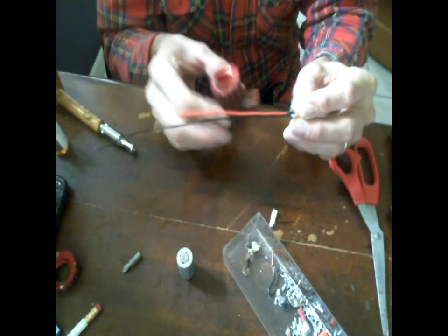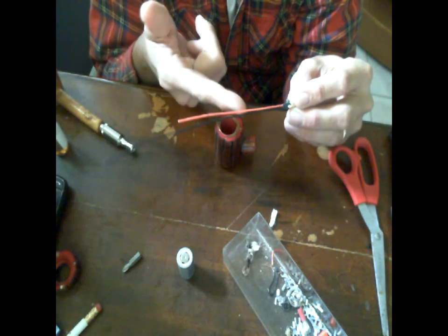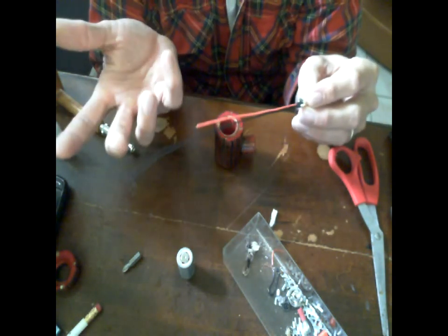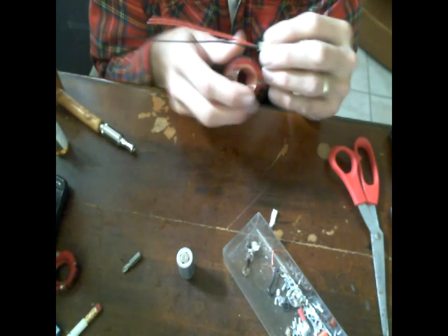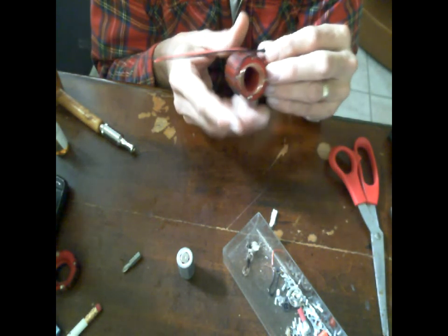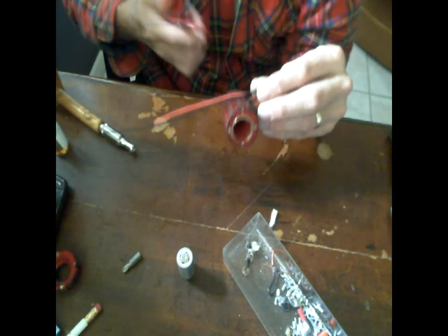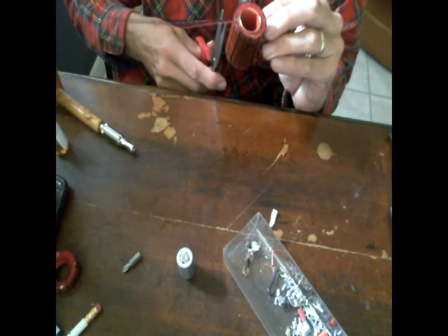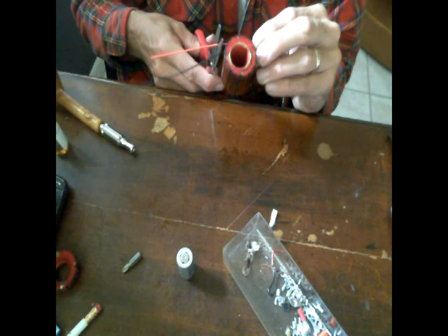You don't have to use a terminal — you could just cut the wire, fold it over, put a solder glob on it. But that's not going to last; eventually that solder will break off and crap out. So I take my measurement carefully. I'd rather cut a little bit at a time so if I make a mistake I can just cut more back. I usually end up rolling the wire, and I'll show you that in a minute. I like to use solid wire for these mods — I don't like braided wire, simply because I have to manipulate and bend the wire and have it hold its shape.